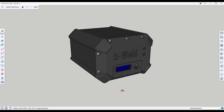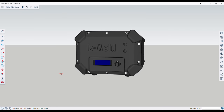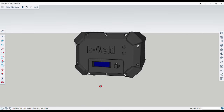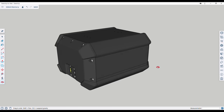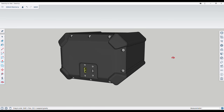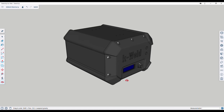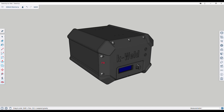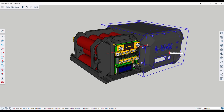The K-Weld is made by KeenLab as a DIY kit that you put together yourself, which is basically just the PCB, a digital display, a foot switch, and the electrode cables. The welder can handle a welding current of up to 2000 amps and has a voltage range of 4 to 30 volts DC, but KeenLab recommends limiting it to around 1500 amps and 12 volts to prevent damage to the welder with continuous use, which is still three to four times more powerful than my old welder.